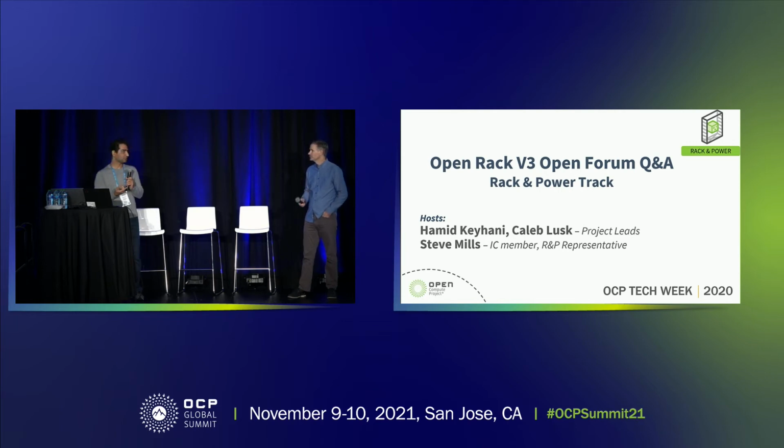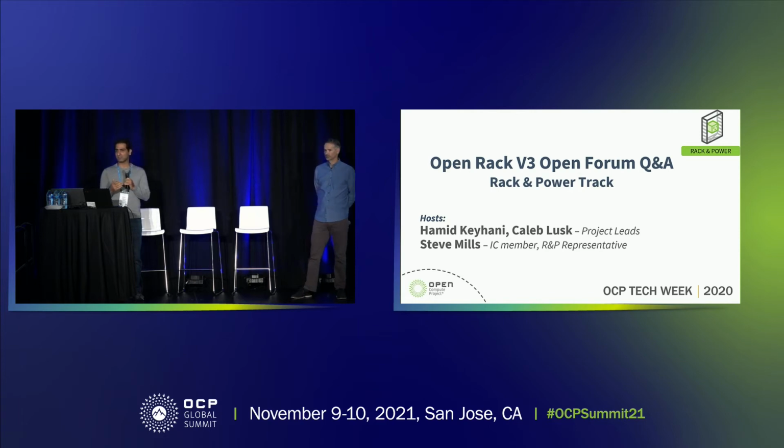The ATS, to explain to everybody, is the automatic transfer switch: if you have two inputs, you can switch from one input to the other one. The current scope doesn't have that. There was not as much requirement from people talking to us. I know some customers or end users, not even showing up at OCP, are interested in those solutions. It's just that there was no end user or customer driving this.